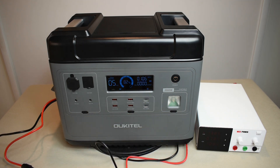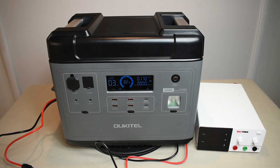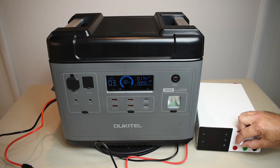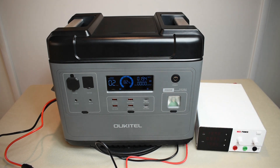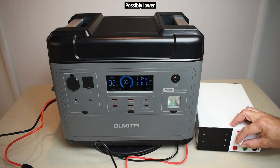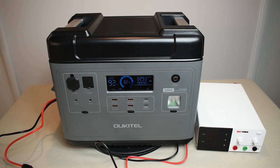Increasing voltage further: at 15 volts we're around 120 watts; at 17.5 volts, 170 watts; at 18 volts, 175 watts; at 20 volts, just under 200 watts. So if you have a 200-watt 12-volt solar panel, that's roughly what you'll get. At 30 volts, roughly 300 watts going in.